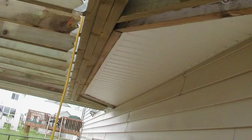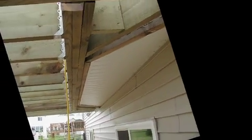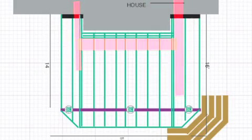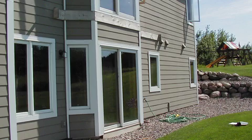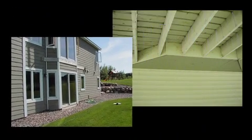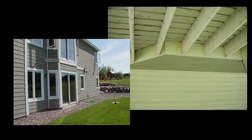The way to deal with this is to build an H-frame that spans around the area — see the H? All the weight now is on the house. This bump out has foundation walls under it, so it'll be fine. See the difference? Support under, no support under.